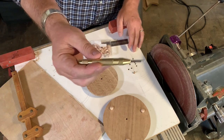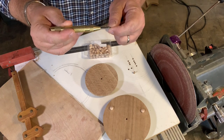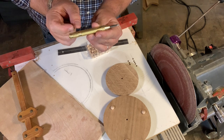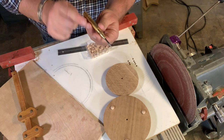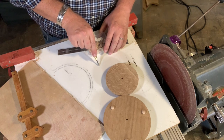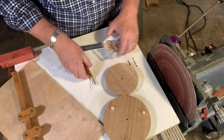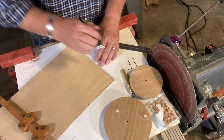If you're not familiar with these, they're super handy. It's a steel punch under spring tension. As we push this down, it compresses a spring, and then a little hammer or anvil flies forward and taps on the backside of that, giving us a nice little impact and leaving a very distinct mark. So that's what I'm going to use. I'm going to make myself a little template with some holes that size to guide it through. Let me show you how we're going to lay that out.